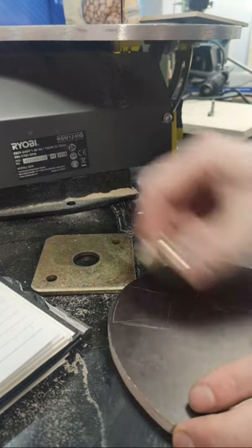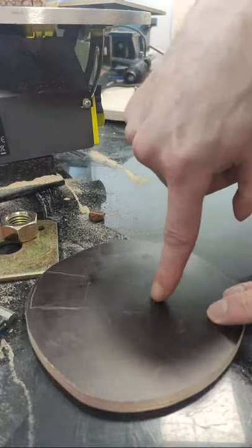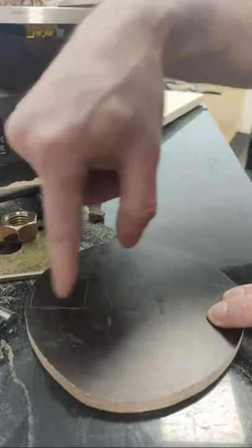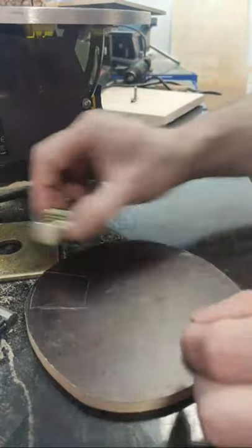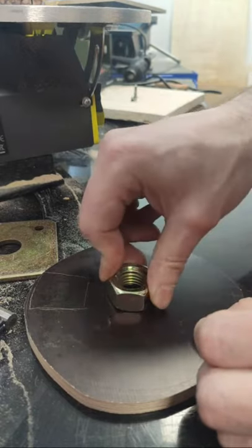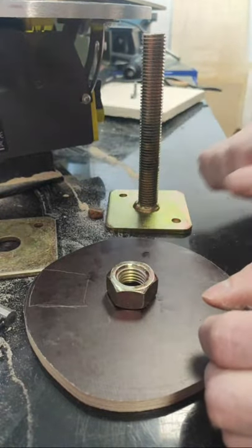So I'm going to mark these out. The easiest way to do this is to take a drill and drill on every part you want to put your blade into. You drill, drill, drill, drill, and then cut across to open up through these. But we do want this to lay inside of here, and that will be based on this center rotation piece.